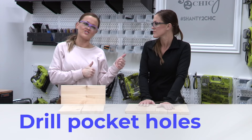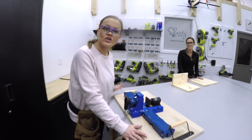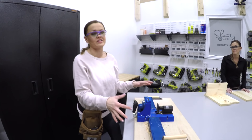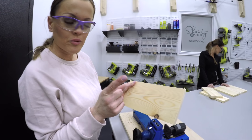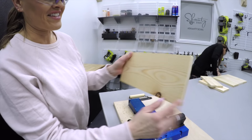The first thing we're going to do is use our K5 Kreg Jig to make pocket holes in two of our three boards. We're each going to make a frame. This is our favorite model of Kreg Jig — we'll link it below because you can build everything with it. We just built a bed with it and now we're building a frame. Two of these three boards cut to 12 inches are going to have pocket holes, three-quarter inch, one on each side.